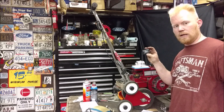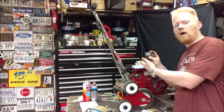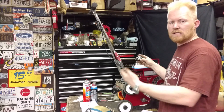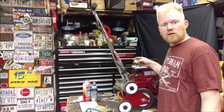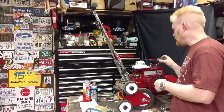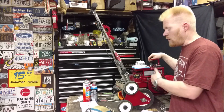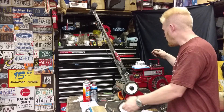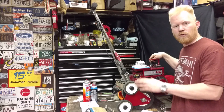I'll put a link below on where to get one of these little hour meters and tachometers — they are invaluable, especially if you have a generator, because it lets you make sure you're running your generator at exactly 3600 RPMs to get the exact 60 hertz frequency you need to run equipment. I'll also put a video link to where to clean the spark plug. This one had a fouled spark plug, which led me to believe the air filter or the carb was maladjusted, so I adjusted the carb.